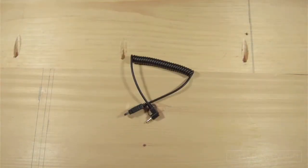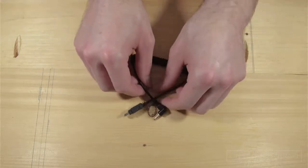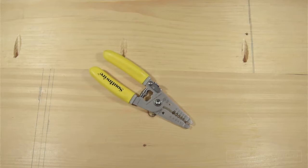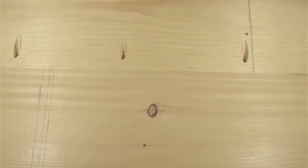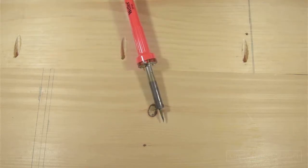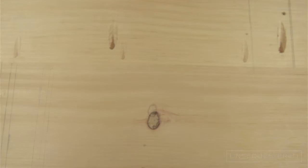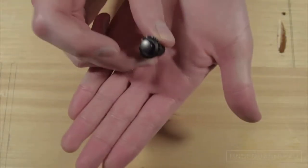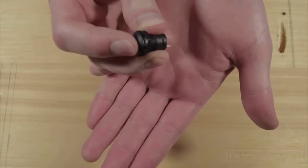To make the simpler version of this dongle, all you'll need is an inexpensive shutter release cable, a pair of wire cutters, and some electrical tape. To make the version that will make things easier for yourself in the long run, you also need some solder, a soldering iron, as well as one of these tiny latching switches. I will leave links in the description to all the parts used for this build.